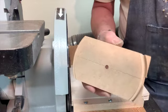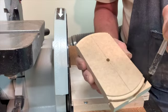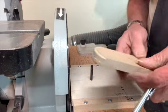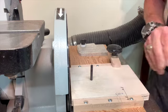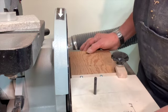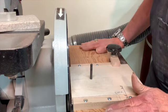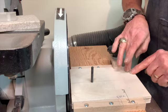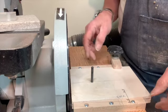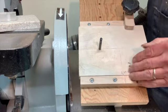An upside of doing this with a circle cutter is that I've actually done it twice, so if I mess this up somehow I've got another chance to recover by using the other end of the tool. This piece now goes on a simple table — just a piece of plywood with a three-quarter inch wide guide fitted into the disk sander table. It is adjustable and slides between two cleats, clamped down via a t-nut mechanism.